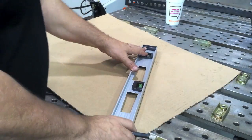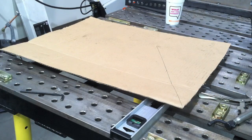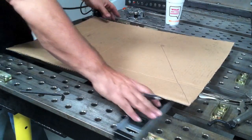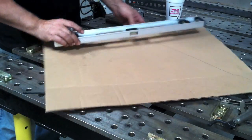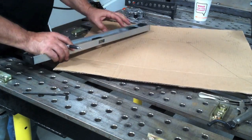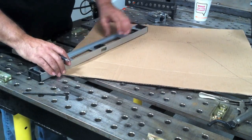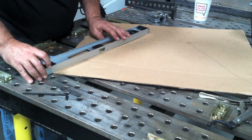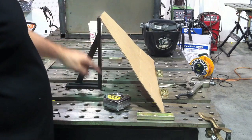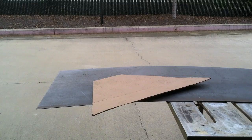I draw a straight line to get my angle. With a little more work and measuring — just crude layout on the cardboard — I want to get an idea this thing's going to work before I start cutting pieces. I get my straight lines and my seven-inch line up top, then transfer the other point seven inches away from the one I marked and come down to the corner. There I've got pretty much the piece I'm going to cut four of to make up that funnel vent hood. Laying four of them up there leaned in like that, it's going to work out just fine.